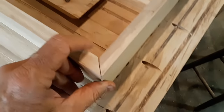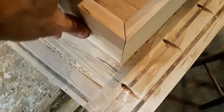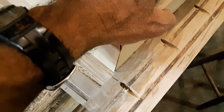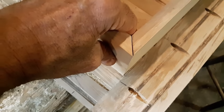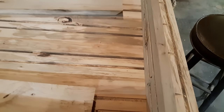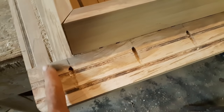This will form a corner right here. You can see my mark where it has to come out to, and this one will come over to here and form a nice 45-degree angle. On the inside here, these pocket holes — I'll glue this first and then screw it, so it will hold it very stationary. As you can see, this board is running in the opposite direction; the grains run that way. I pocket hole screwed it into the ends of this.